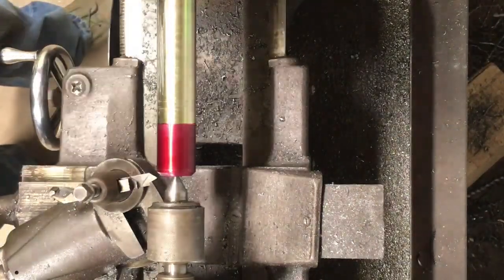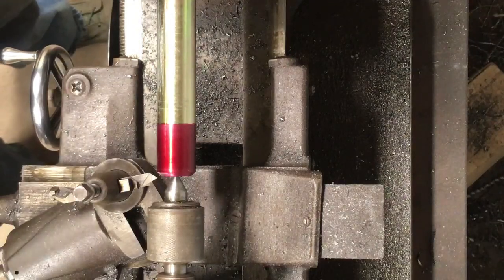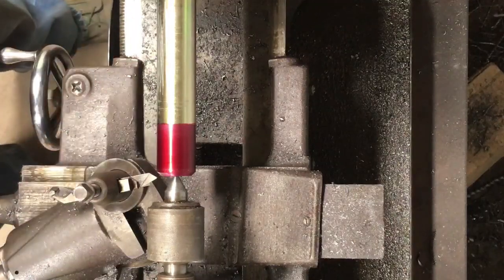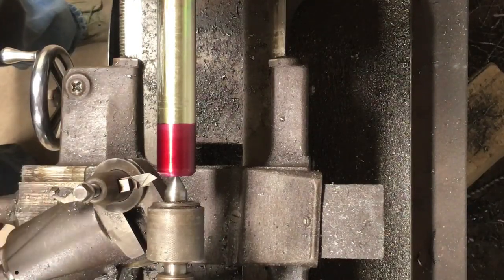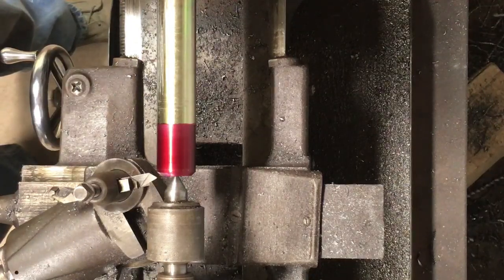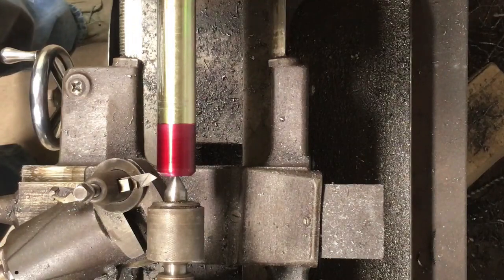The inconvenient thing about cutting metric threads on a standard lathe is that once you engage the feed, you can't disengage the feed, otherwise you'll lose timing between the tool and the part. So what you do in between passes is you back the tool out and you reverse the chuck to drive everything back to the beginning of the cut. What stinks about this lathe is it does not have reverse for the spindle — the motor only drives forward — so I'm going to have to take it out of gear and turn the chuck back by hand every pass, which is probably not going to be a lot of fun.